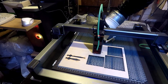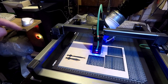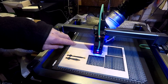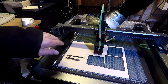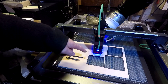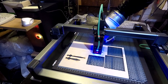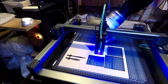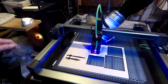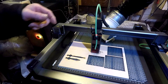I wish they had come up with an air assist for it - it's pointless having that pointer showing when you can't see it because the metal plates inside block the back of the red panel. I just printed the nozzle off, picked up some silicon hose - and it has to be silicon hose because it needs to be flexible.